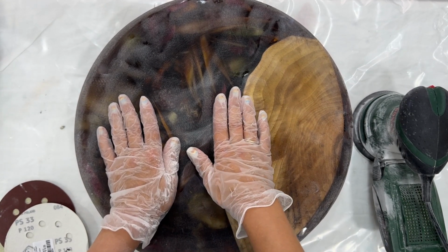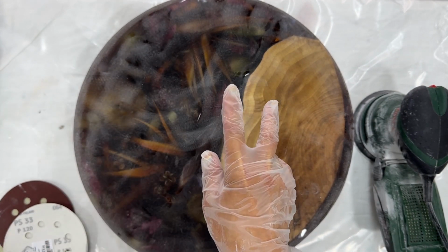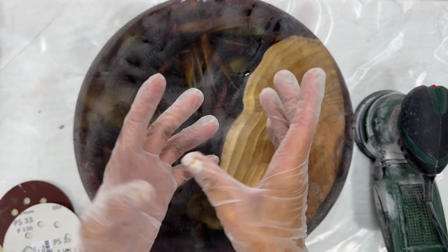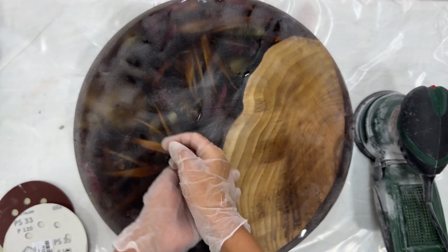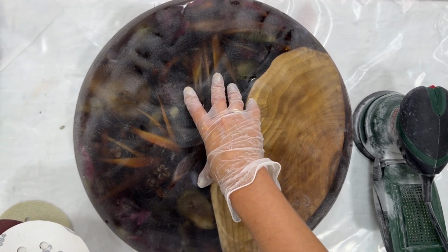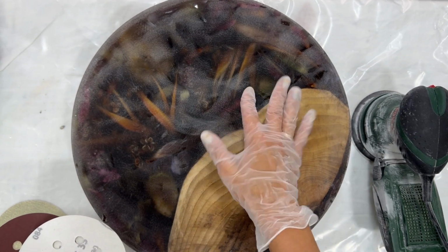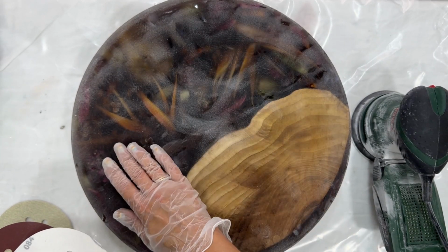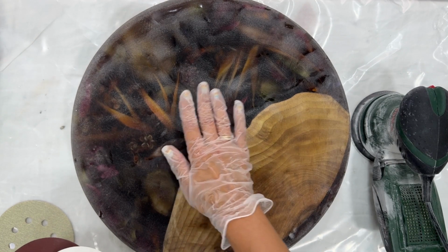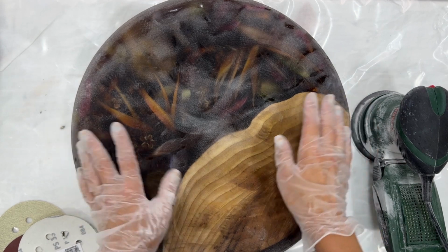We must necessarily grind the surface, necessarily level it, and necessarily grind it. It should have a grain. For pictures, you can take two sheets of grinding paper, for example 320 and 380 to 400. You should keep in mind that we are grinding to the finish up to 400 grit, as in the grinding of the tabletop. And of course, we start from the lowest grain. It all depends on how damaged the surface is and how much formwork you used. I go from 80 grit to 400 in steps.